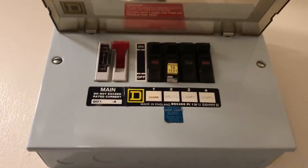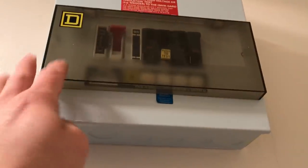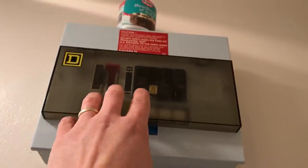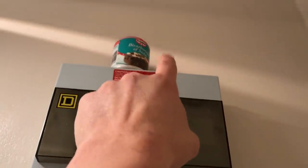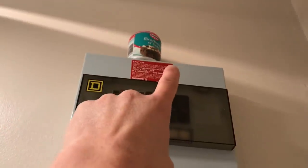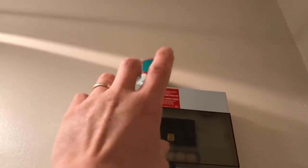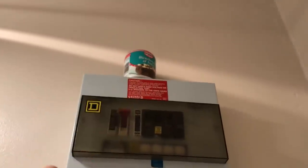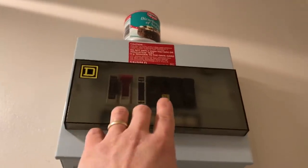So you come in the front door — this is a first floor flat, so ladder access for outside. First thing: there's an old Square D board and these breakers are really hard to get hold of. As I'm working in the bathroom, I'm going to put the lighting on an RCD. I'm going to pull the lighting feed out of here, cut a flush box or surface box in, and put a 30 milliamp RCBO — a 30 milliamp spur up there with a 3 amp fuse, because that will fuse my fan and lights down to 3 amps. 6 amp here, 3 amp there, RCD protection — cable goes off to the lighting.